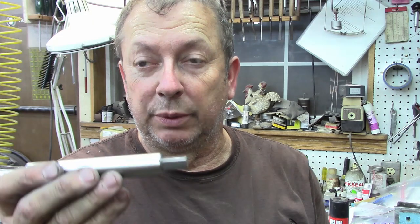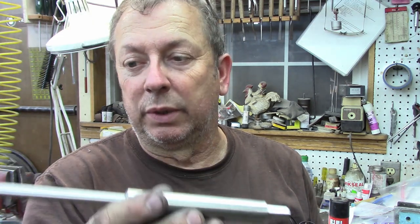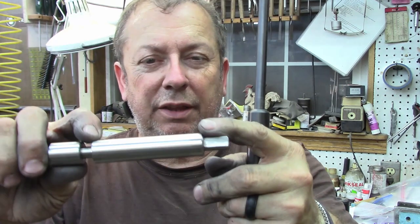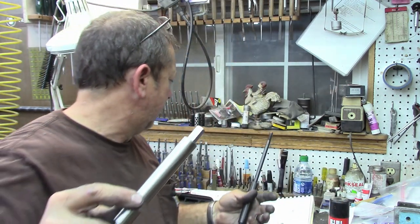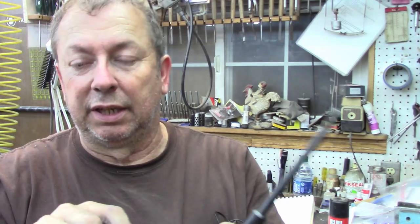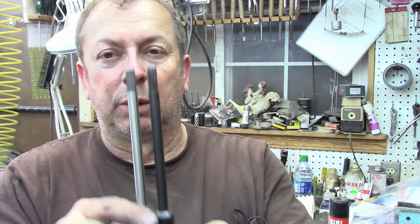It's got to be long enough to where you can get your wrench on the end of it without interfering with the headstock cover. You don't want it sticking way out there in the wind. And inch long threads here, 3/4 inch for your shaft here. I think they call it 3 5/16 is that length. 3/4 inch diameter. You know, this is going to be 3/8 diameter. So anyway, there we go. Quick and easy. Make Atlas machines affordable again.